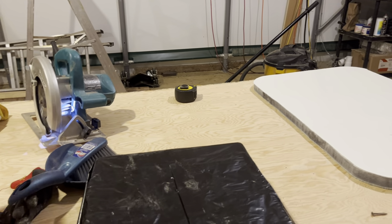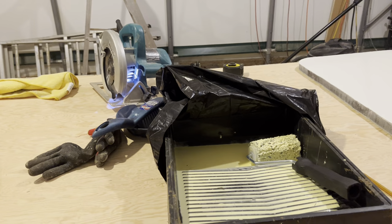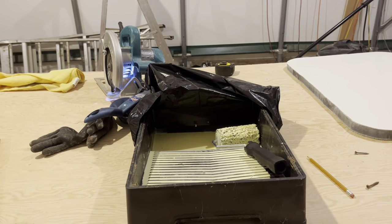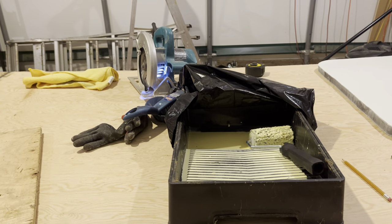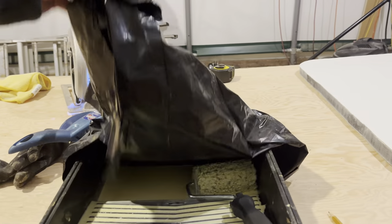This is the way I spread glue. I use a paint roller and a glue tray and a paint tray. It's a lot easier and quicker than trying to squirt it out of a bottle, and this way you can cover everything with your glue.